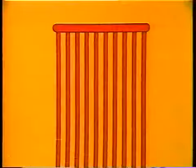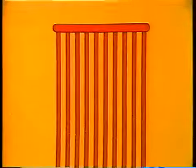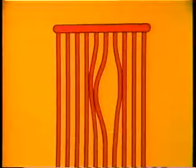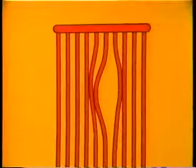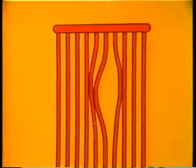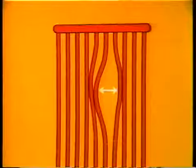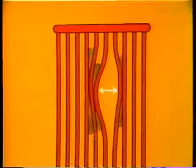Superheater and reheater tubes are supposed to be in line and parallel to each other. If warping has taken place, the tubes will literally stick out like a sore thumb. Warping may also cause an additional problem. Warping alters the distance between tubes, which in turn changes the flow pattern of the gases passing through the superheater. The flow can then become channeled in such a way that erosion increases on some tubes while ash builds up and collects in other places. Check for these when you find warping.